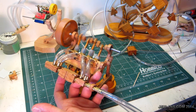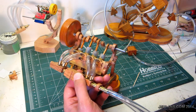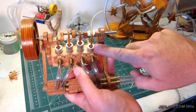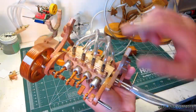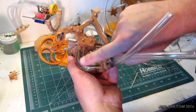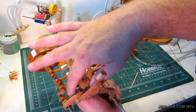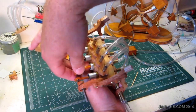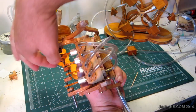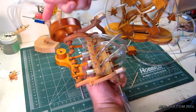It should run smoothly — just using a small hand pump here to run it. Essentially, the piston is a switch; it switches the air flow. So let's say you have pressure going in here, and then it switches when it's open out this way. It opens the air flow out to the piston it's paired to, then thrusts it. That way you have the continuous motion.